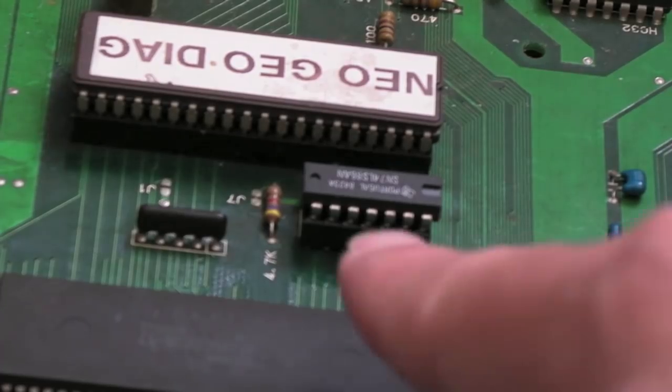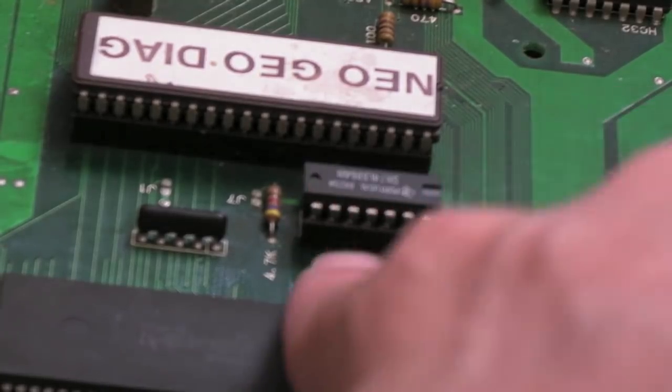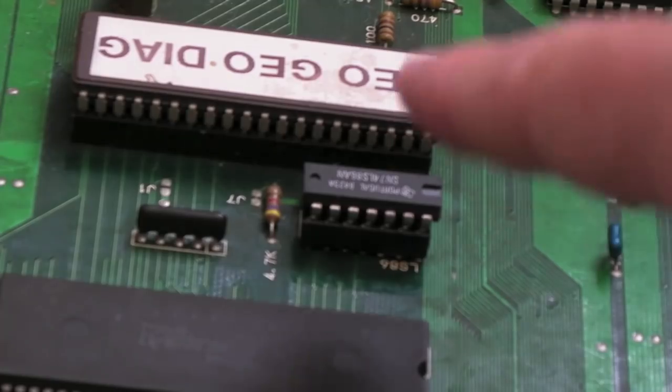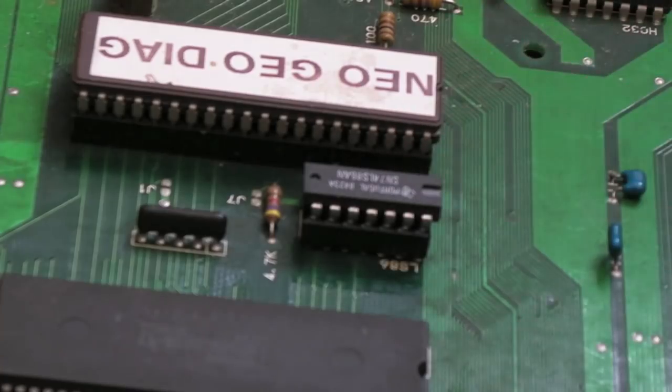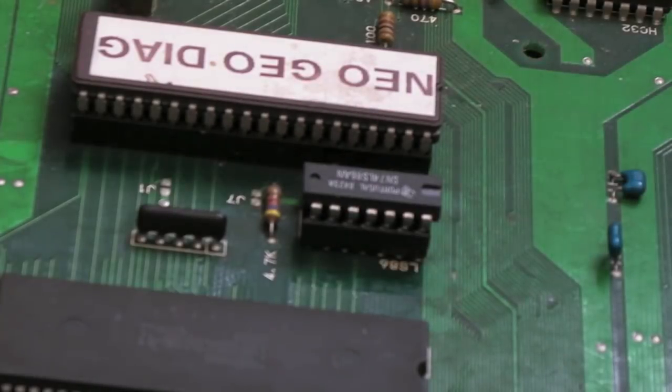I was worried thinking I'd destroyed the pro C0 or the CPU, but it was just a trace that had burnt out - I'd just shorted out the supply. I'll show you that later but there's a lot still to do on this board - that'll be covered in the second video. The main purpose of this video is just to get some life, which we've got. I might just try and reinstate some of the chips and see if we can test a cart within this video, then we'll report back on the next video for the final state of play.